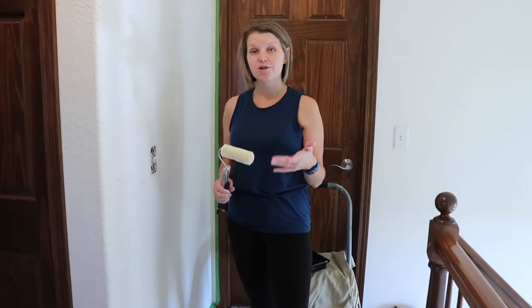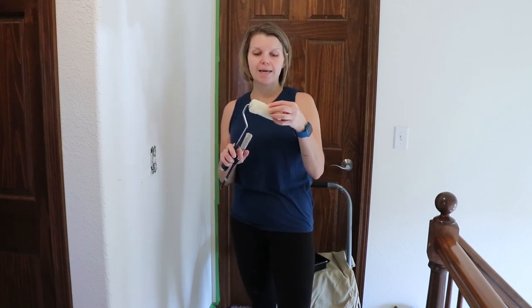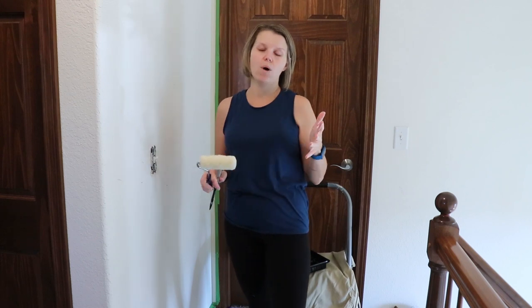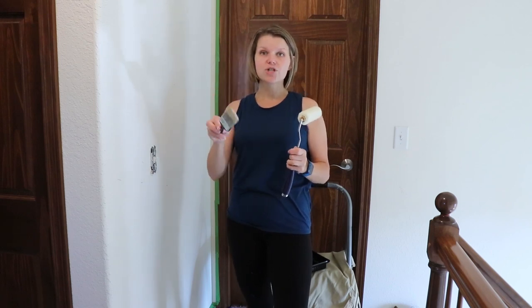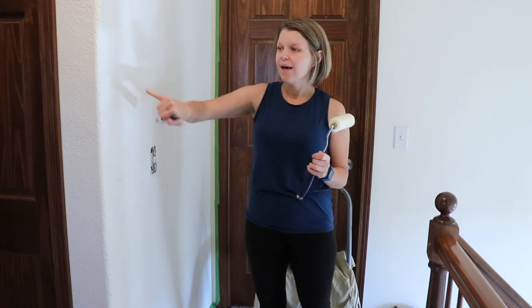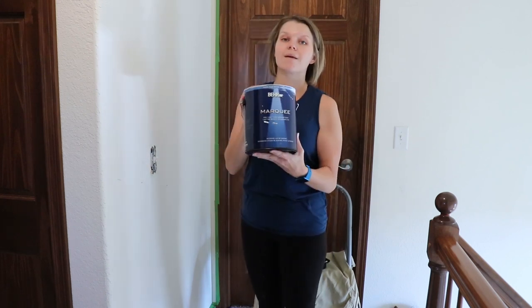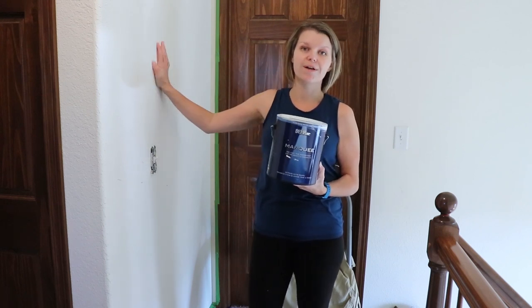When you're painting a textured wall you want to use the right kind of roller. This is a roller with a medium nap — it's actually pretty fuzzy and soft — and this is going to help get the paint in between all the grooves on the wall. Like when painting anything, do one or two very light coats and let it dry a little bit in between for the best coverage to avoid any drips. You also want to get a good brush so you can go along the corners, edges, and baseboards to get a nice crisp line. I really like Behr Marquee paint — this is ultra bright white in a semi-gloss — and I'm going to roll this onto the wall.